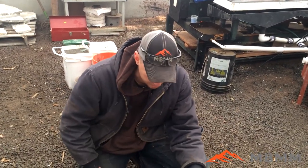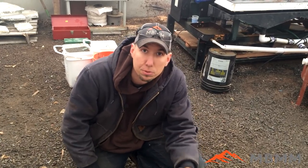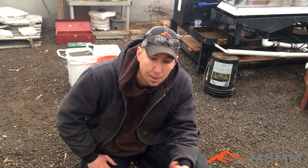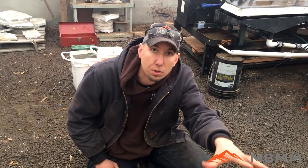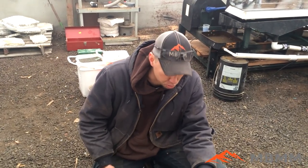So this is a huge amount of value that people are throwing away that we actually can recover with our shaker table and our hammer mill. I am super excited to see the results — I think it was an absolutely perfect test. We're going to play with different screen sizes in our hammer mill. I think the hammer mill is really important to help break up the paper, copper, and fluff. There was one point where we tried to feed it right onto the table and the material floated off, so it needs to be wetted or mixed somehow. But I think we can get huge throughput and recover a whole bunch more metal for these guys that they're losing and throwing away right now. I hope you enjoyed the video — there's going to be more to come, and I'm really looking forward to seeing you guys in the next video. Thanks for watching.